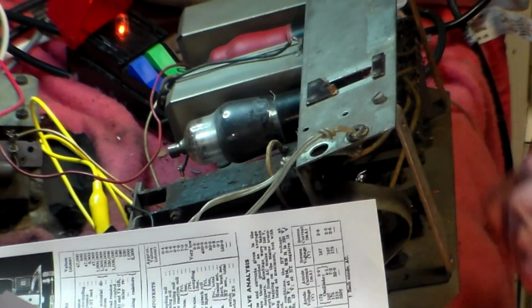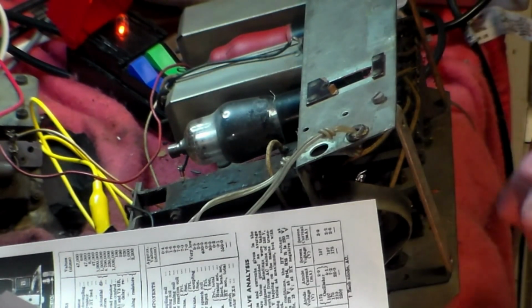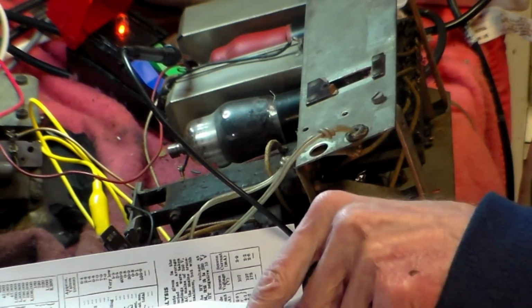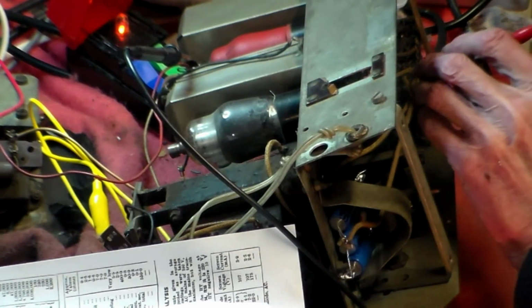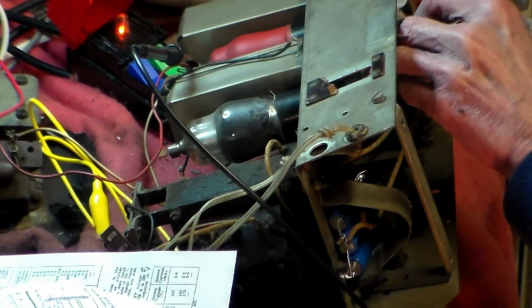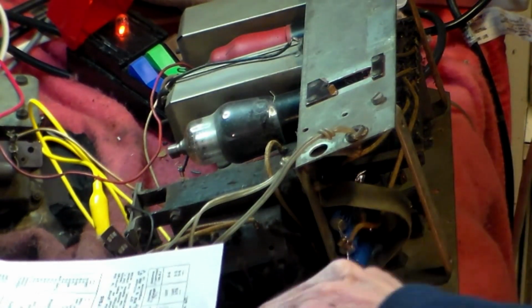And so therefore one end of this should go to R8, shouldn't it? In fact, they both should. So from the top of there like that, it should go down through here and to one end of R8. Let's see if it does. It does. Right, so that's okay. Phew. Right, okay, so I'll get the capacitor to put that in and we'll see what happens then.